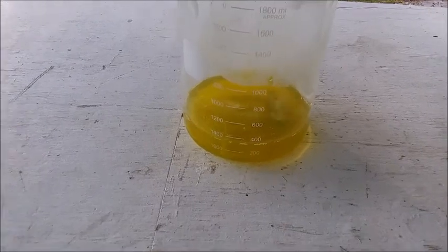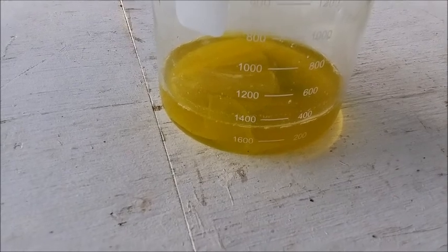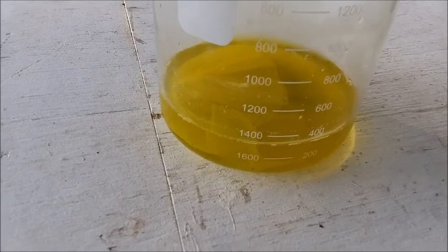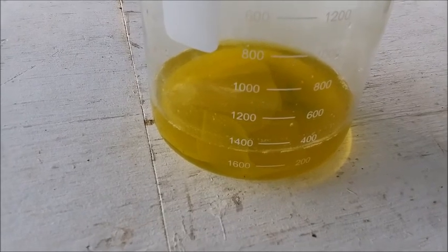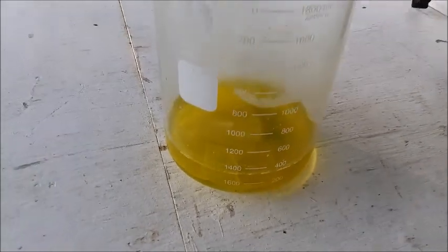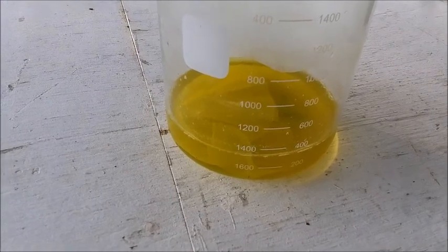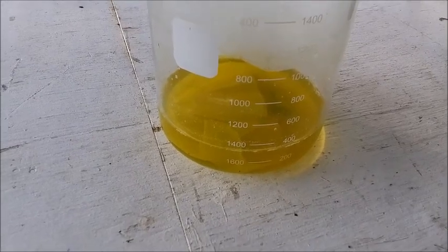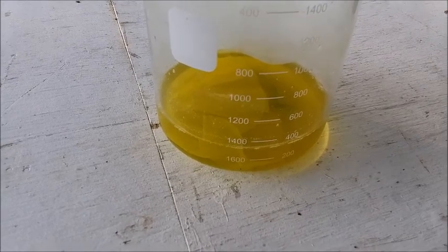I went away for 20-30 minutes, worked on some stuff on my honeydew list, came back — and all the gold is dissolved. There's nothing left in here but the filter paper and some sediment and miscellaneous stuff. A few cents worth of chemicals and I've dissolved gold, made chloro-auric acid. This is exactly the way I did it when I was getting started out. The next step would be filtration and then dropping the gold out of solution. But that's going to have to wait for another day, because the wife just told me to button up my mad scientist lab and come grill some steaks for dinner — and that's something on the honeydew list I don't mind stopping for. We'll pick up tomorrow with filtration and dropping the gold out of solution.